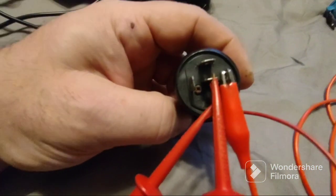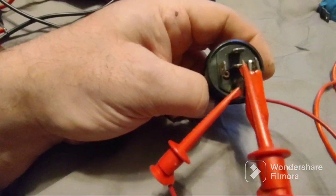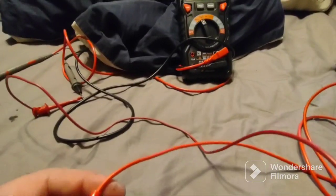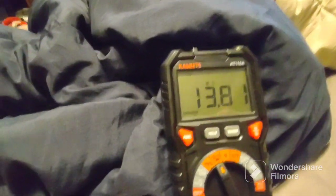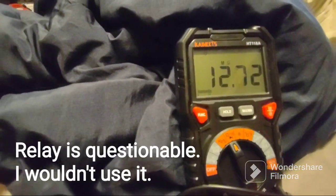The alligator lead is on 85 - that's one side of the coil. We'll touch the positive of the battery to 86. This is the normally closed one, so pin 30 is on the bottom and pin 87A is the center one. I have a clip lead on pin 30 and a clip lead on 87A. What do you expect the meter to read? Zero ohms - they're connected, there's no power going to the relay. Now I energize the relay and the meter goes to open or mega ohms. It should really be a complete overload - this one could be on its way out.